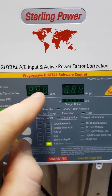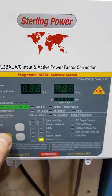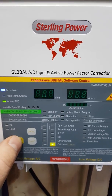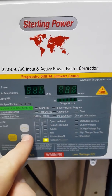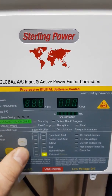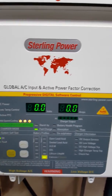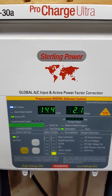Now this is your bulk voltage — set that to the absorption voltage that you require. So let's say 14.4, that's your typical absorption voltage. Press enter there, and then this one here is your float voltage. Let's say typical float voltage is 13.4. Use these cursor keys to modify the voltage and then press enter. After you push enter, the unit then fires up at that desired charging profile.